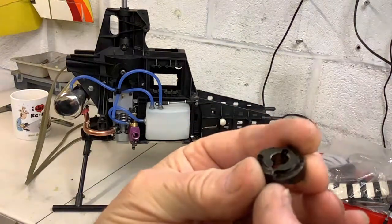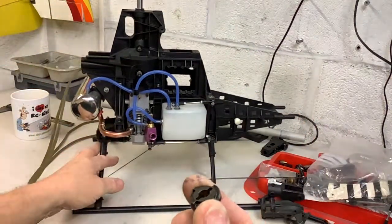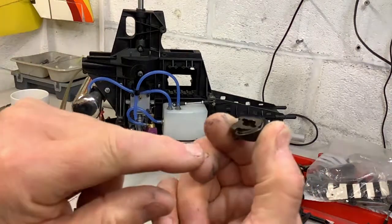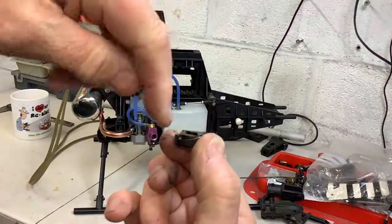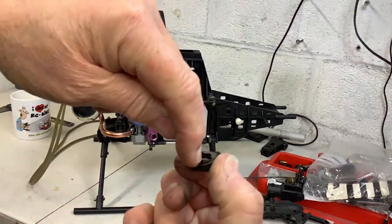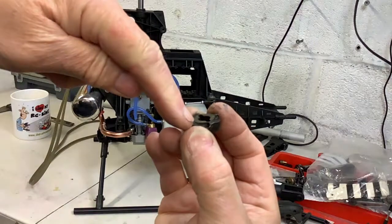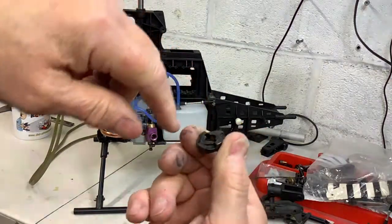And in the bottom, there's a lot of bits that make up that main shaft that goes from the top to there. This is on the bottom and it's driven, and you can see the shape of that. In the upper part that swivels, you've got 2 little spring loaded pins. So when it drives, it goes against that face there, so it pushes that round, and that turns the blades. And when it freewheels, they just ride over that. So it goes click, click, click.